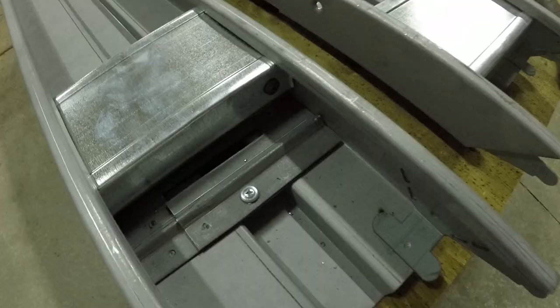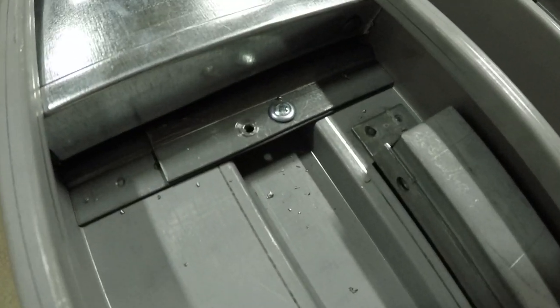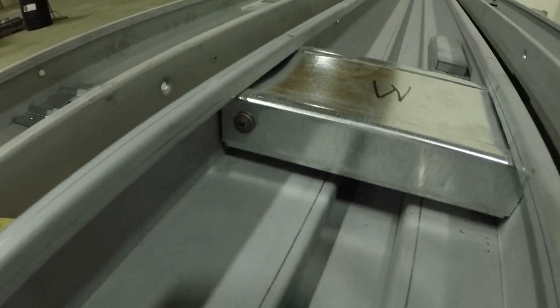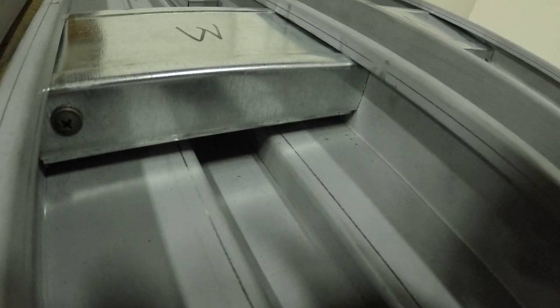There you go. You can see the screw in each one. I had to make adjustments on that one. But yeah, 4 7/8 finished there for the 3 5/8 wall, double or single layer 5/8 both sides. That's a 1 hour fire door. See there how tight that is? Every clip is tight in the jam. That is important.